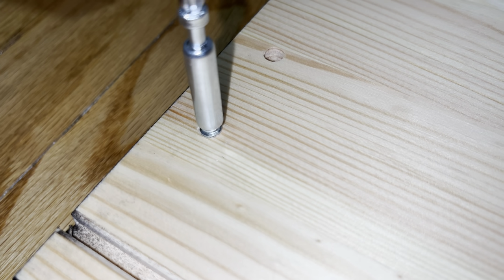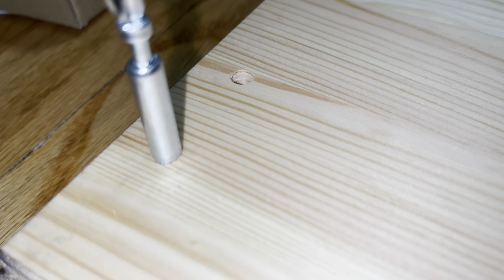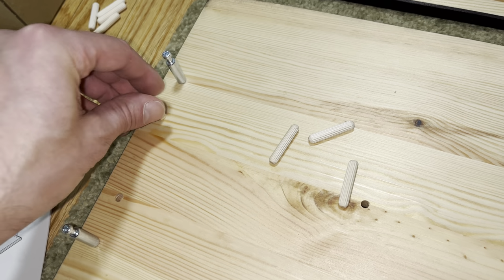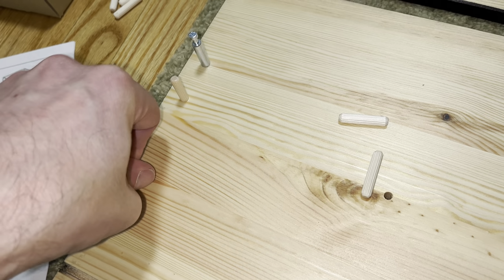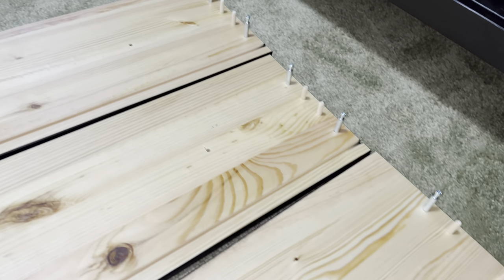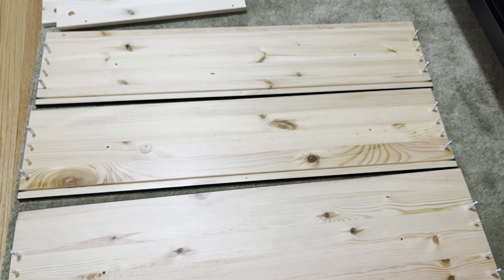And we're going to find also these screws here again that we have to screw in here, but we don't screw those in too deep, just so that they touch the wood. And then in the center two holes are for the wooden dowel. So let's stick those into all of the fronts of those drawers. So now this should eventually look like this here.